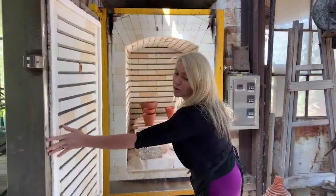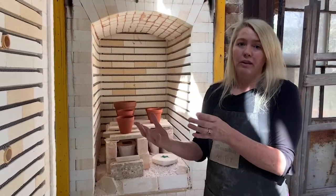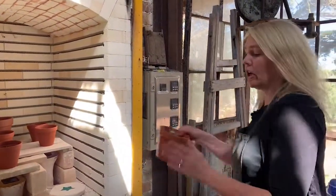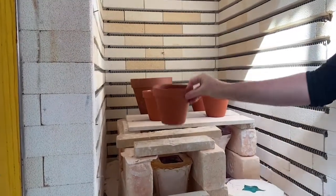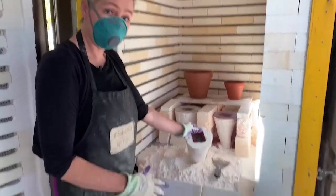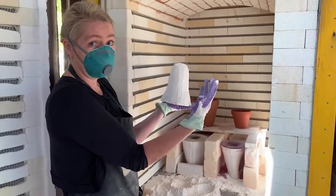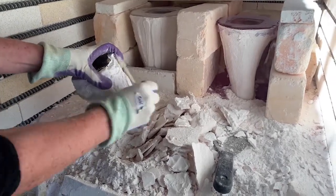Last week I talked about making a hand in wax, covering it in a mold that's good for glass melting, melting the wax away, and then turning the mold upside down. We then put a crucible full of glass on top of the mold and the glass is melted through the hole and into the mold. So now we're going to reveal one of the hands. What we're seeing at the top here is just the base of the hand — the full hand is underneath. When you've got fingers that are quite delicate, you don't want to break them off, so it's important that we go slowly.